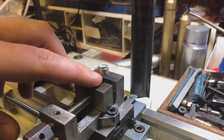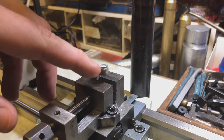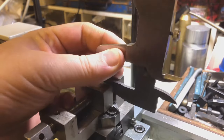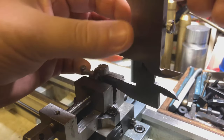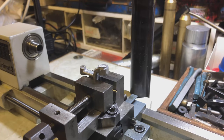You can also visually check to make sure these two bosses on the end line up completely vertically, which they do — so I know this is now perfectly square. This total thickness needs to be 188 thou. I've got quite a bit to come off — right now that's measuring 300 thou. A lot of that is still the gate left over from when they cast the part, so that's the first thing to take off. Let me bring the cutter back down.